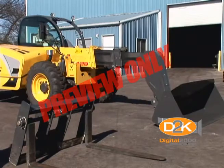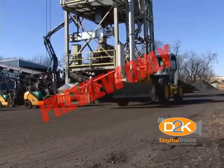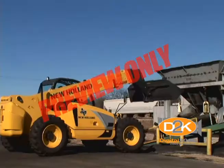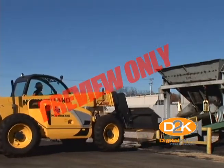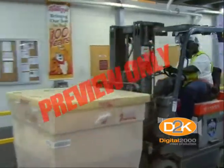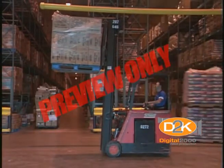Trucks equipped with attachments shall be operated as partially loaded trucks when not handling a load. This means the attachment may be heavy and the truck is considered partially loaded when using an attachment. A load engaging means shall be placed under the load as far as possible, and the mast shall be carefully tilted backward to stabilize the load.